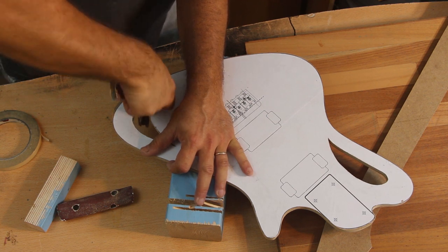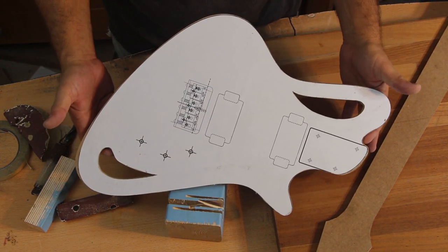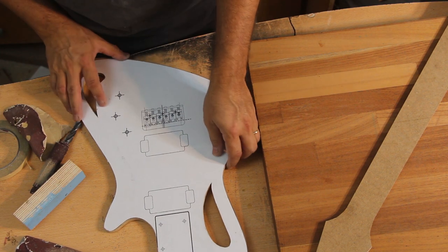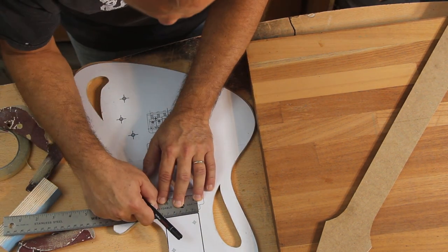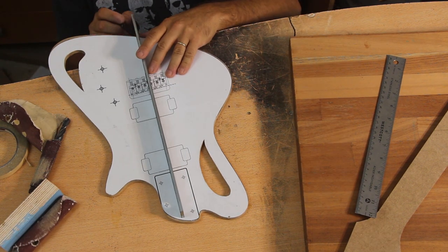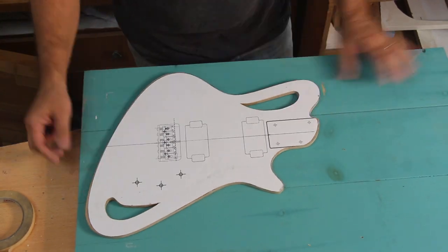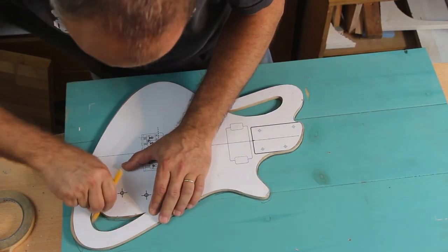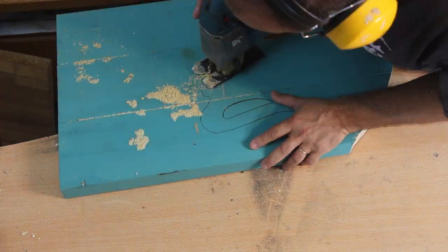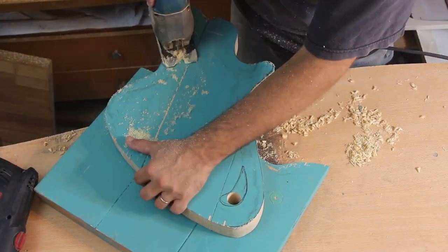Now to work out the final body shape and test out my new rasp, I'm not going to jeopardize my Iroko — I grab some pine from an old project to use as a prototype. There are a few issues I want to check: the ergonomics, since you really need to hold the body against you to be sure; where and how much material to remove for both design and structural reasons without making it too thin and brittle; and the overall size and positioning of the cavities and switches. I cut out the shape and drill the holes to get the rough form, wanting to route and drill everything while the top and bottom are still flat — it makes the whole process a lot easier.